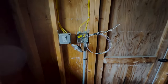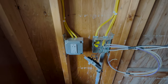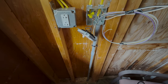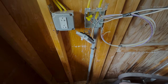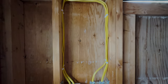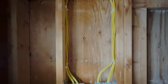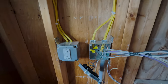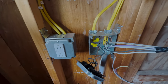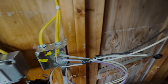Looking at the electrical at the moment — in a previous video they ran the electrical through the bottom of the shed. They needed to get from one side of the house to the other, and basically just run electrical through the shed, which is a nice bonus for me because now I have two 20-amp outlets in the shed. Here are the ends of this Romex. This is our power lines. If you look at the black and the white, these are our two separate hots coming from the basement. And then here's our pastel yellow and purple. This wire is actually flexible — this is 14-gauge wire that's coming up.